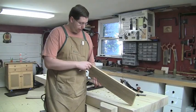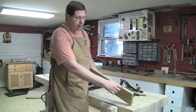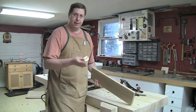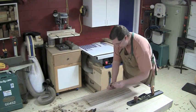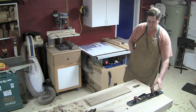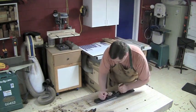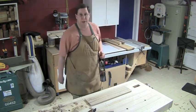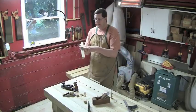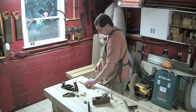One thing to remember is, like we did with the winding sticks, I'll come around and look for the narrowest part of the board and set my gauge to that. Lay this line down again. In that instance I removed the marker in one swipe, focusing on keeping this new face square to the face that we've already planed.